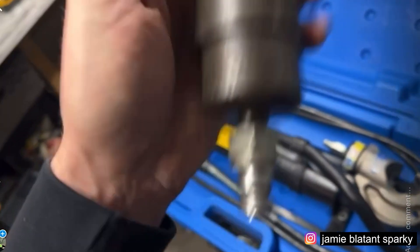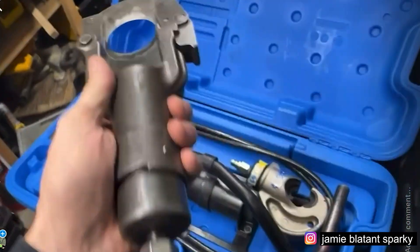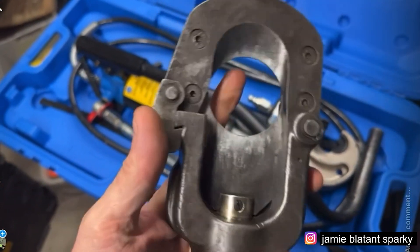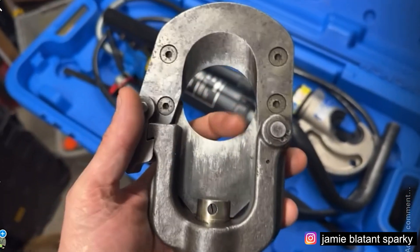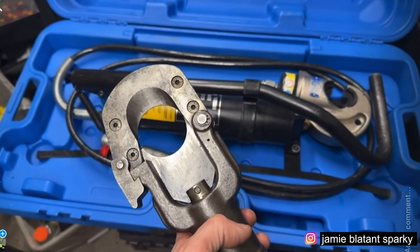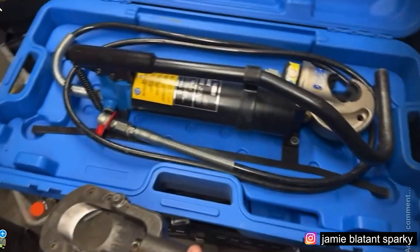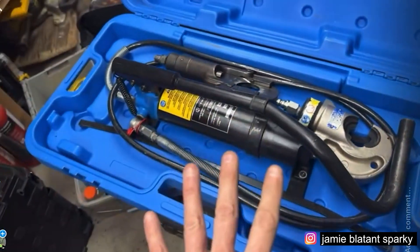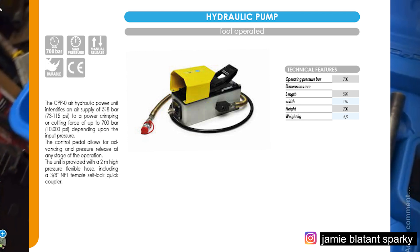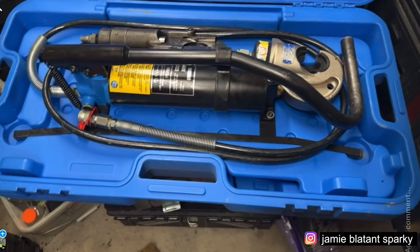This is the cutting head - quite an old one I bought off eBay for the last solar farm job. It is a Cembre one and takes the Cembre quick release. You just clunk it off, put your cable in, do it back up. That cuts up to about 63mm or 50mm of copper, no problem. I've also got an absolute monster cutter that will cut 63mm steel bar, though it only works with the hydraulic kit. I've also got hydraulic foot pumps that need a compressor to run, which saves foot pumping on site.